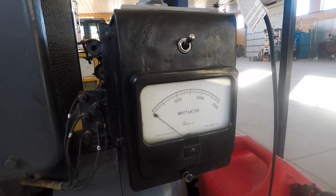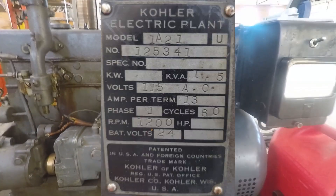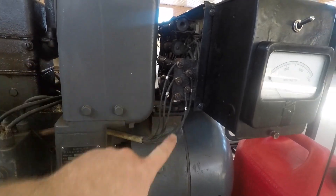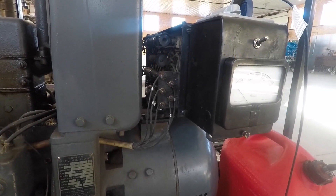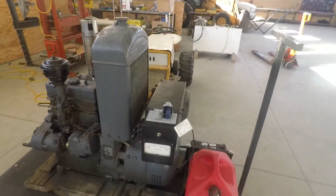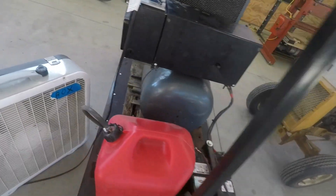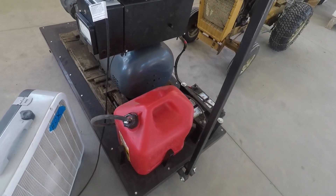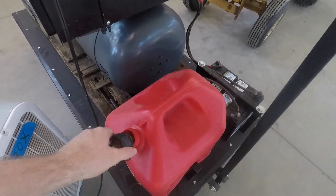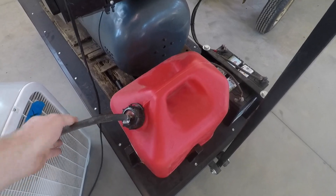I'll throw a good picture of the nameplate in there for you. If you've got one of these and you want to run it manually because the electric start's broken or whatever, you have to unhook this bottom wire here, which is the ground to the magneto — then it will go ahead and start for you. To shut it down, you'll have to ground that wire. This box has the automatic start mechanism in it. I've got my batteries here, and a little jerry can for fuel. I set this up so if I want to change barrels while it's running, I can just pull that out, put a new jug on there, and it'll keep going. It runs fine while you change it out.